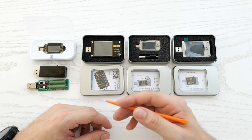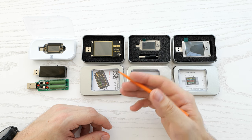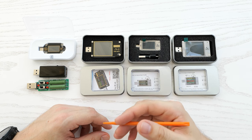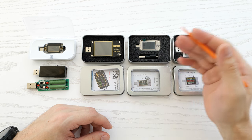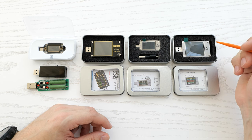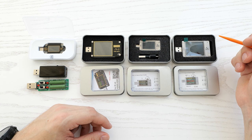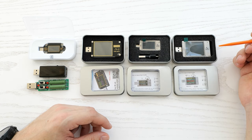Today we're going to take a look at these USB testers, which are in my opinion the best. I use USB testers on a daily basis for laptops, smartphones, and power supply diagnostics. These testers have pretty much similar features — they can measure voltage, current, temperature, power, load resistance, and if you charge a device through the tester it will show you an approximate battery capacity. These four can also detect USB port protocols and trigger power delivery and different quick charge modes.